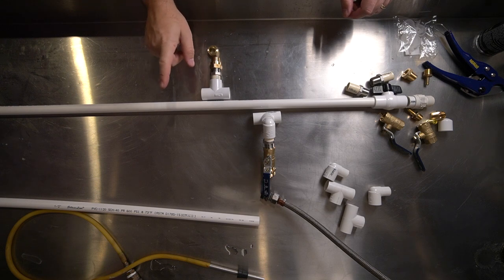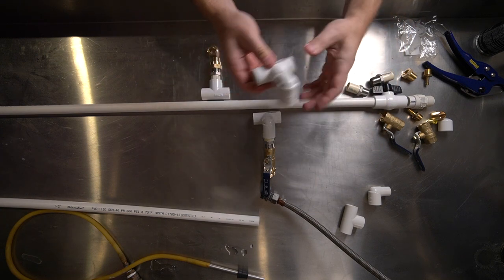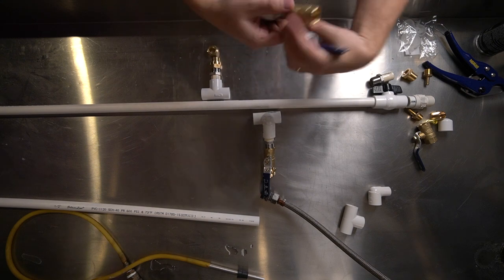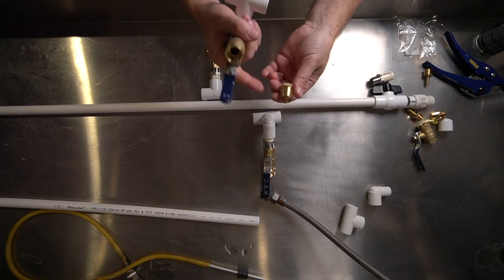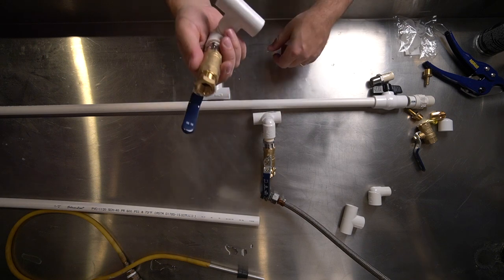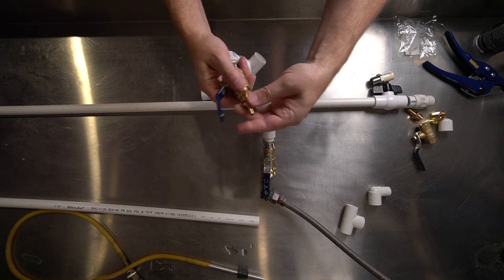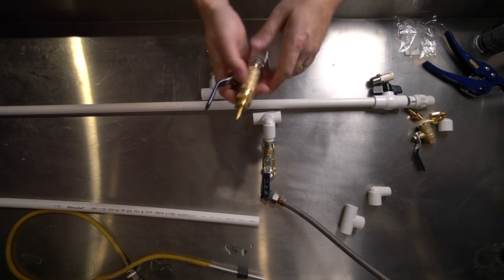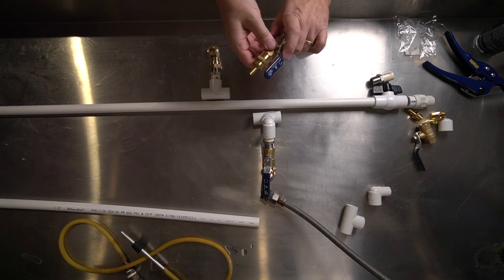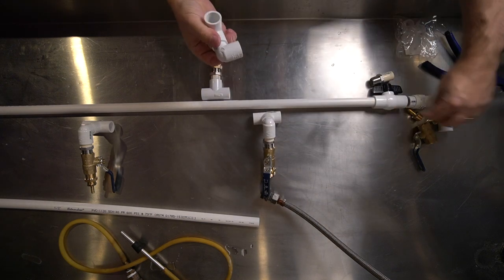So from there, I will then need two pieces, another divider, another piece to hang over, another thread, another valve. And then I've got this thing here, which reduces from 1/2 inch to 3/8 thread. So all of these threaded pieces will use Teflon thread tape. And then I've got this piece, which is a 3/8 inch thread to a 1/4 inch barb. And that barb will connect to my latex hose that I've got more of laying around here somewhere. So I've got that, and then I should have enough to make a second one.